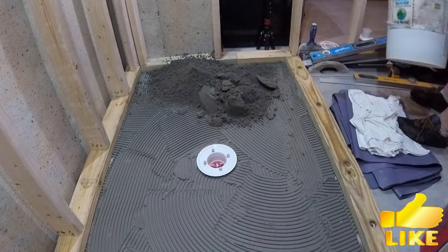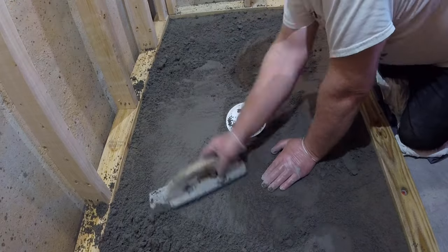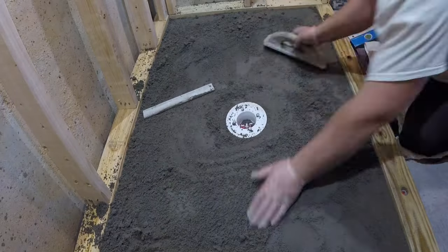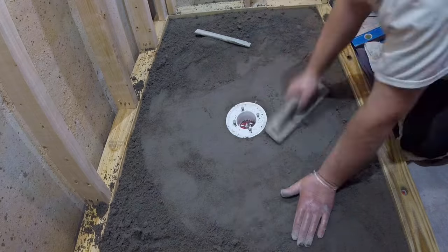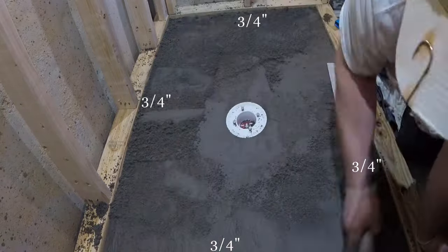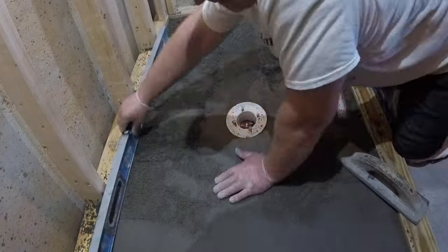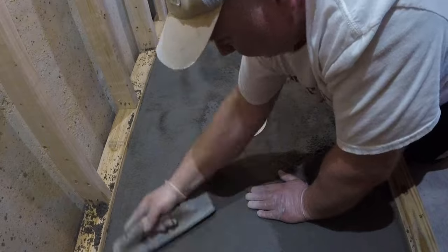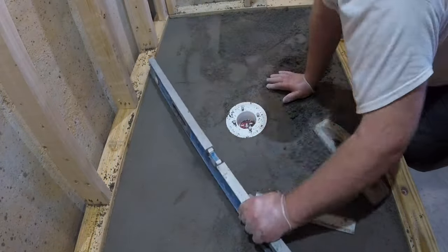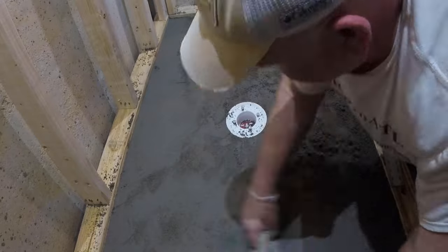This is a dry-pack mixture and it's pretty easy to spread it around the shower base. When you're working with it, you shouldn't have any water on the surface. First, you want to spread an even layer around the shower walls, because that will be your starting point. In order to have a proper pitch, you've got to have a quarter-inch slope per foot on your pre-slope or shower pan. In this case, the drain sits about a quarter inch above the shower floor and the furthest wall is 24 inches away, so the pre-slope has to be at least three-quarter to one inch thick around the shower walls. Start working on the longest wall first, set the thickness, and level that area. Once you have a perfect level between two walls, transfer that level from one wall to another until you get a perfect level all around the shower base, and then from it you can build a gradual slope towards the drain.